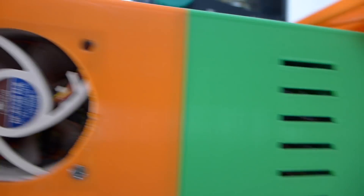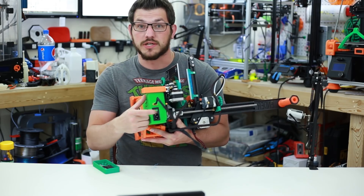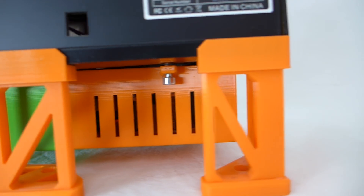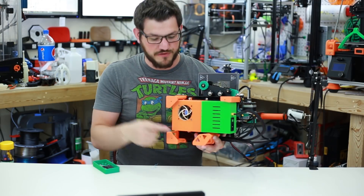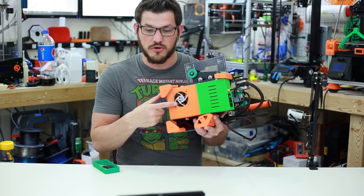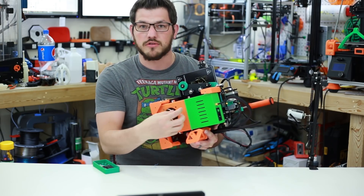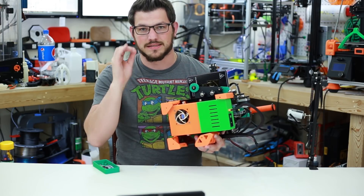At the bottom, there's my custom enclosure for the printer. By adding this I was able to add my own power switch, which the printer doesn't come with — once plugged in it's just on. There's also no protective cover for the power supply, which I think there should be. I modded the feet slightly to add space for the power supply cutout. And there's a Noctua fan sucking air through the front and sides, blowing it out the bottom — it keeps the power supply cool and it is dead silent.